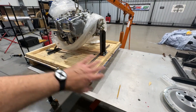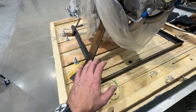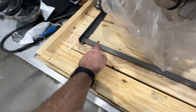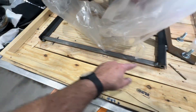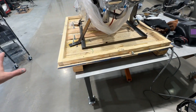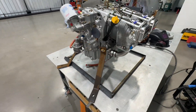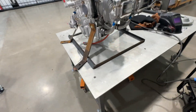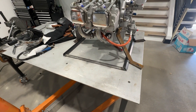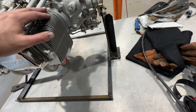Really just getting it a little bit lower and getting this clutter out of the way. Here's what I got — it's kind of hokey, I guess. It's plenty strong enough. I used some scrap angle iron here, and since I didn't have any more angle, I used a piece of rectangular box section with a pretty heavy wall, and just welded this square up and welded it to these supports. Now I can hoist it up, undo all the bolts, slide the crate out, and it should just sit down self-supporting. That did it — I've got the weight off and it's just sitting on that framework, getting it down about six inches. A more respectable height to work on.